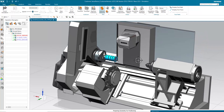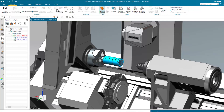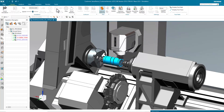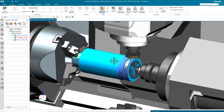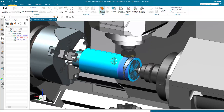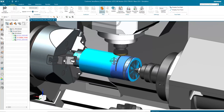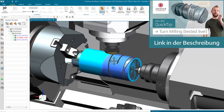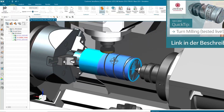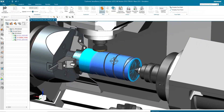Now I have the part that Thomas just showed on his computer already clamped within my machine context — the devices are there, the machine is already here, and I'm eager to hit the play icon to see the simulation. While the simulation is running we can zoom in and see that the very first path with the tool goes cylindrically around the part, and once it finishes in that direction, it begins movement in the Z-axis. If you are interested in how to get this operation running on this part, we have a quick tip on our YouTube channel — click on one of the links below or Google it in combination with Janus Engineering.